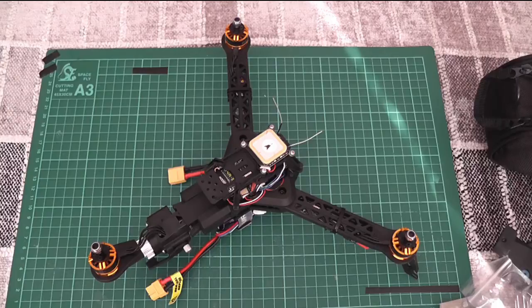I didn't pay much attention, and I was a bit concerned when I got them and found that the wires were very thick — they used 3mm bullet connectors as opposed to the 2mm ones on the ESCs. I had a look at the specs and discovered that they drew 35 amps swinging that six-inch prop on a 3S battery, so obviously not much good with a 20-amp ESC. So I had another look around and ordered these DYS motors.